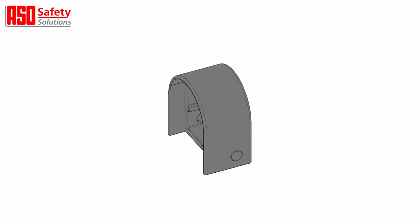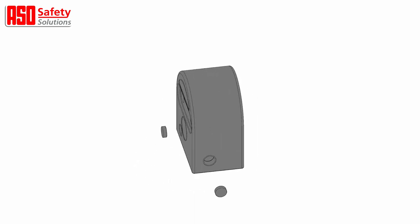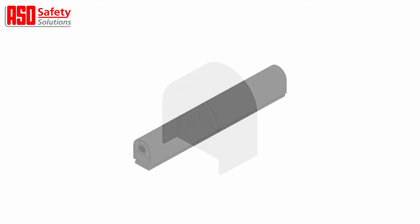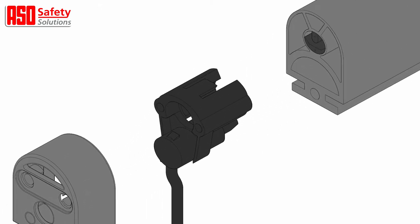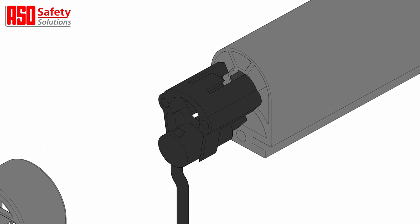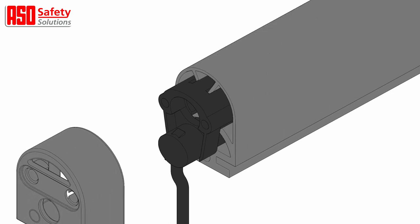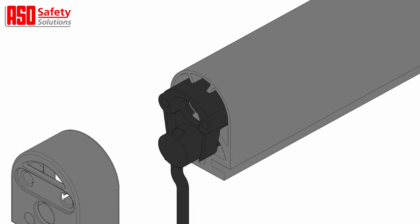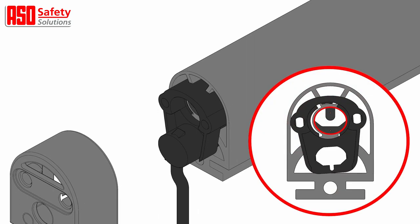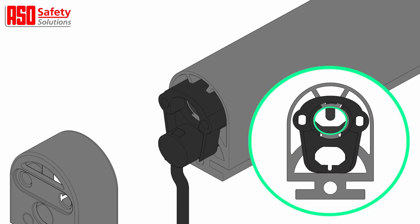The end caps have pre-marked areas for the cable exit. Choose the desired cable exit and push or cut it out. Push in the lock cap including the attached plug into the hollow spaces surrounding the switching chamber. Ensure it is tight to the cut surface of the safety contact edge — no gaps should be present on either side. Check whether the outer wall of the switching chamber abuts the lock cap; slight rotational movements of the lock cap can additionally help achieve this.